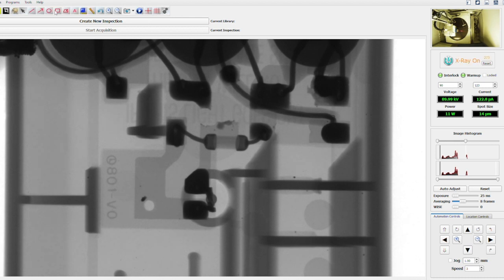Just to give you an idea of exactly what happened: there used to be a trace right here that went from solid state to liquid state when an over-current happened. It works like a fuse — you have too much current going through the trace and it melts, breaking the electrical connection. This is one area where the trace just melted away.